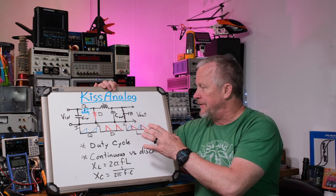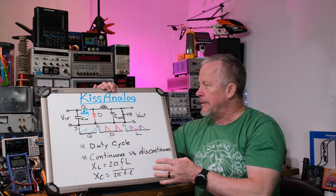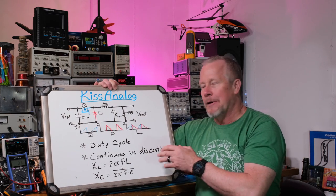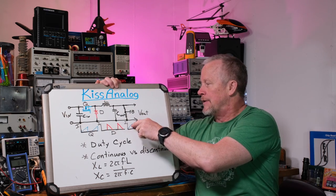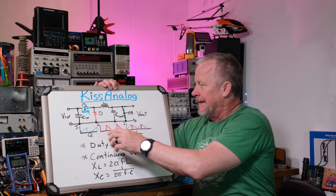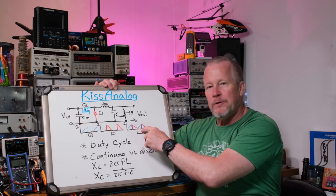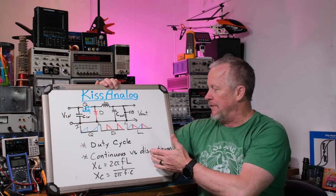Let's say peak currents are two amps — then you have one amp DC current equivalent. I'm also showing roughly 50% duty cycle here because the time on and time off for the transistor are the same. The other important point is the current level: the charging cycle ends at the same peak level where the discharge cycle begins, so it charges up to say two amps and then starts at two amps and discharges. This is what I call critical conduction — as soon as the discharge finishes, another cycle occurs. It's right on the boundary of discontinuous and continuous.